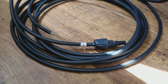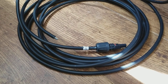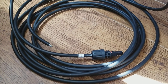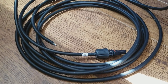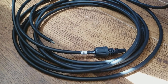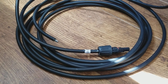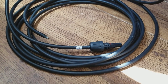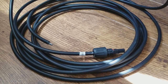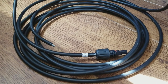These are super easy to set up — this just clips into the connector in the back of your solar panel, and you get a bare wire that can go into the back of your charge controller. Renogy sells these in everything from about a foot all the way up to a 50-foot version, with thicknesses from about 16 AWG down to 4 or 6 AWG. So if you can afford to go for a lower AWG rating and a thicker cable, it definitely can't hurt. Or if you're going to a higher voltage system, want to save a little money, or don't mind a bit more power loss, then you can go for the cheaper, thinner, higher AWG rated cables.